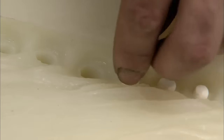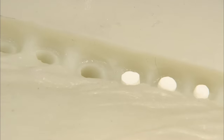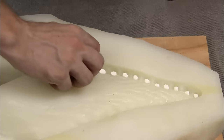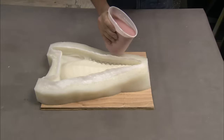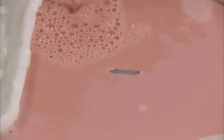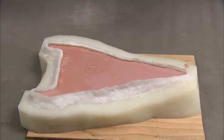The teeth are now placed back into the jaw mould. The jaw holds 60 teeth, each up to 2.5cm long. The teeth are then covered with flesh-coloured dental acrylic to form the Raptor's gums and palate. Once the mould is filled, it's placed back in the vacuum chamber where the gums and palate cure and harden.